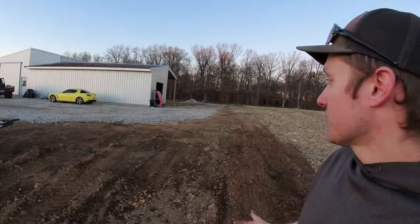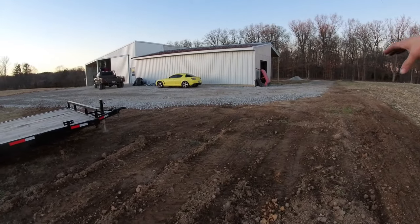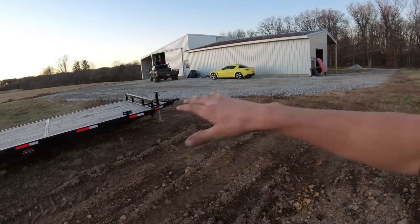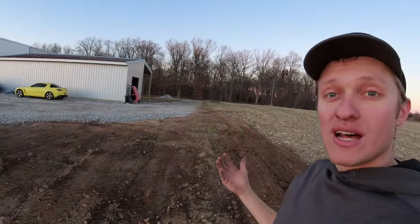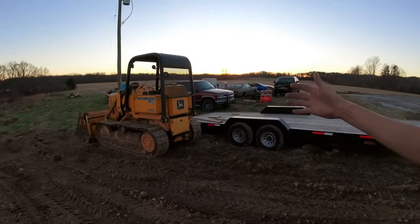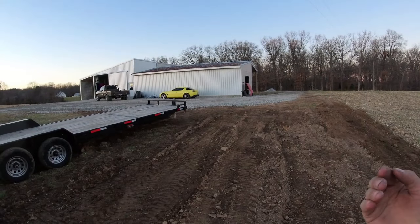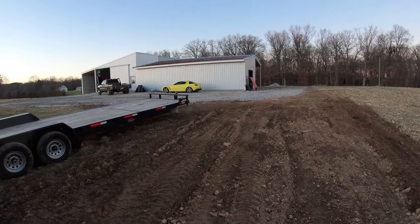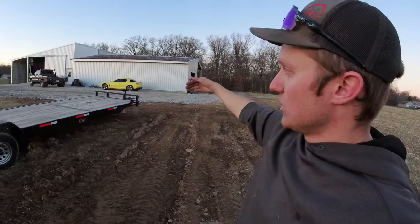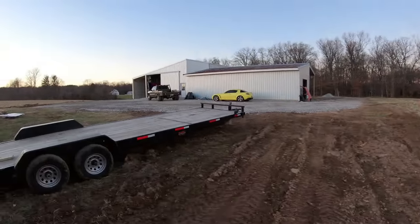You need to understand the water patterns around your building before you dump a bunch of money into it — you don't want to build and have flooding. Right where that roof is on this corner, I had a big soft spot where the road was at higher elevation. With the old lean-to just having livestock, it didn't matter if it got muddy, but once it was enclosed it did. So I brought out the big dozer and clipped this hill — water is now flowing toward the camera and draining south, running down by my parts cars into the creek.